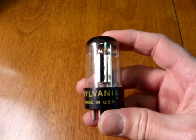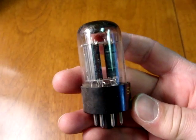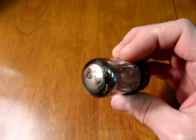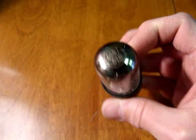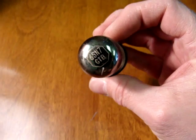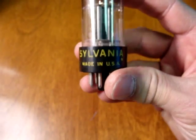The later versions from the 1960s looked like this. The bottles were a little shorter. They had the same plates at angles to each other, but the getter flashing is the clue — it's usually a darker color and does not extend all the way down the sides of the glass, only just covering the top of the tube. These also almost always have a thin base, not the wider base.